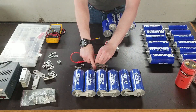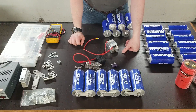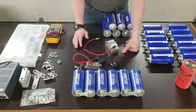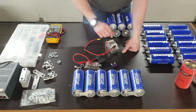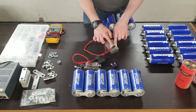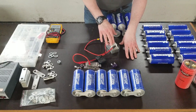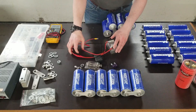I connect one end to my charger and the other end into my maxi fuse block. Essentially you want to introduce some series resistance between your battery charger or power supply and the capacitors to slowly bring up the charge — you'll feel the resistors dissipate some heat. If you have a current limiting charger, great; if not, throw some series resistance in there with decent power handling. I used to run 15 ohms, then added some in parallel to speed up the charge. That's how I charge them.